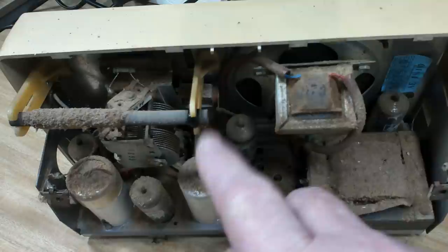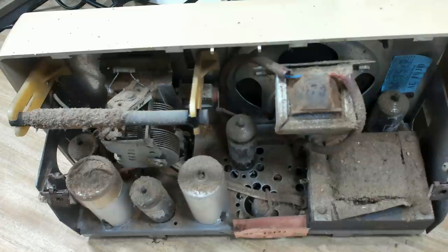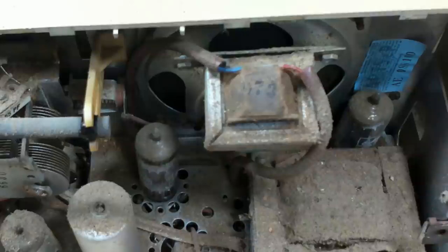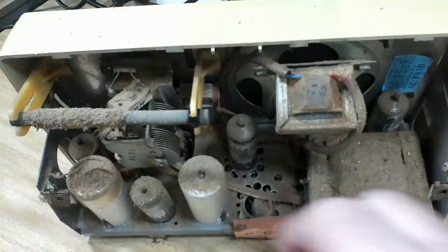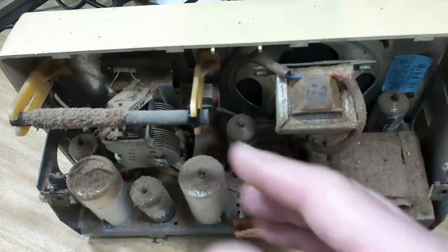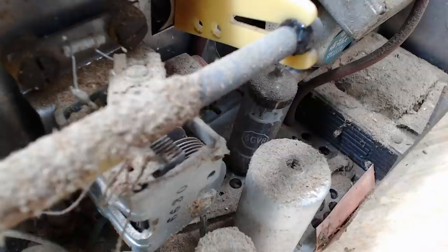The back took a little bit of struggling to get out. This is really dirty - it looks like it's got sawdust on it or something - but it certainly doesn't look like it's been touched since 1970-odd. I notice it's got a rectifier in it; they later went to a silicon diode. So it's a four-valve set, which is a bit unusual because they've moved away from reflex sets.